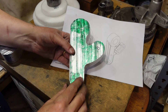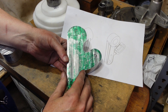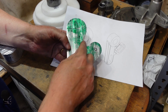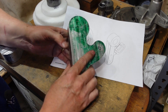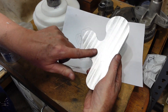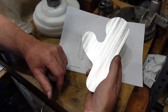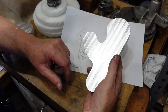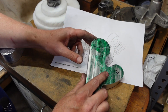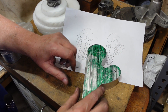As you can see I've got my basic shape. Now I just have to take off some material on this side — there's probably about a 12mm piece that comes off here — and on this side there's a little bit of relief that goes around there, and then there's a wad that comes off here. I'm going to leave that till last because I might have trouble holding it if I do this bit first and then flip it over. So I'll find a block to block that up and then do the rest of it.